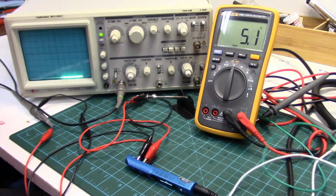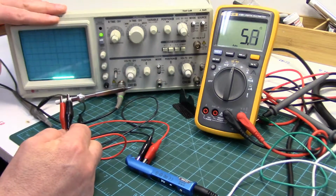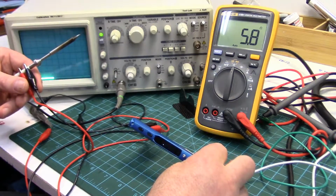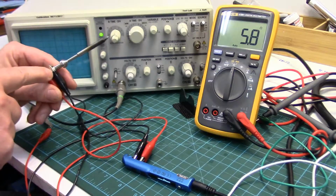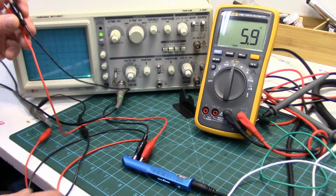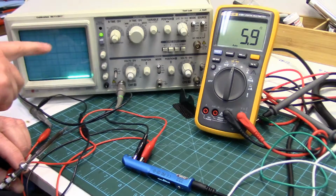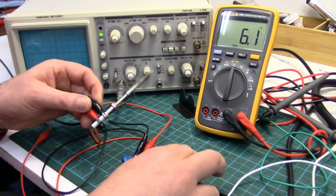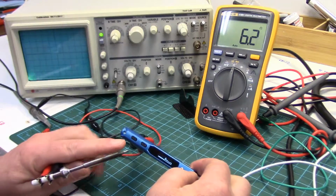So the other thing I wanted to see is what the voltage looks like going to the tip. All I've done here is I've got my little TS100, and the contacts that the tip usually rests against, I've just got some alligators hooked up to it. Two are feeding the oscilloscope so we can see the voltage and how it's pulsing it, and two going right to the tip, of course. So I'm just going to turn this on, and we'll keep an eye on the scope here.